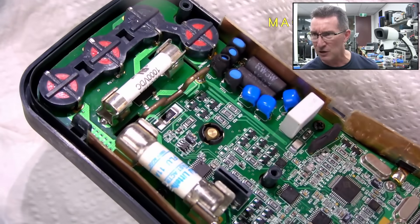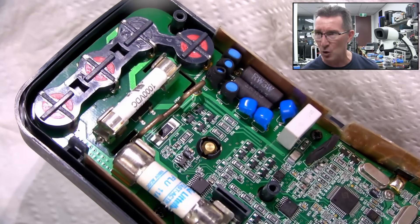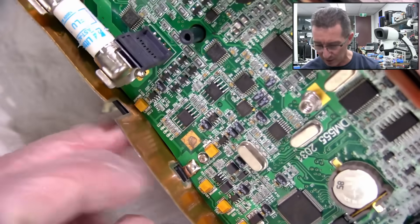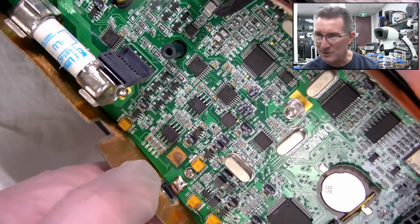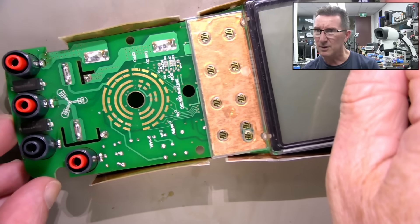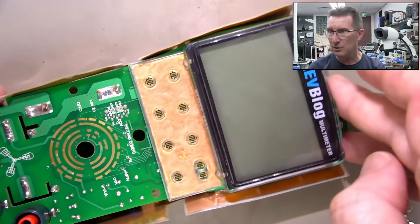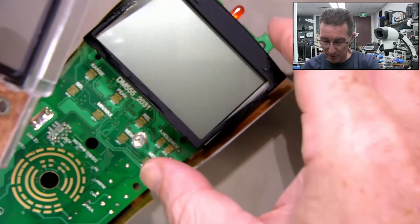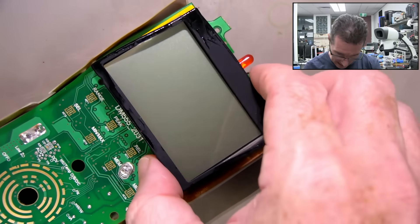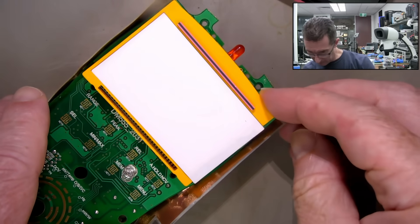The spring is like — you could put it back in and your product would work, but long term you'd wanna be getting a new set of contacts. The good one still has its plating completely on, so that one's alright. We've got one battery contact which is perfect — but whack those side by side and you can really see the difference. That is terrible, Muriel. I think we have protected the PCB. Everyone will say to put the entire board in the ultrasonic bath, but unfortunately my ultrasonic bath is not big enough for this board — it's just a little smidge too wide. So I got the board out. We have to get all the screen off here.